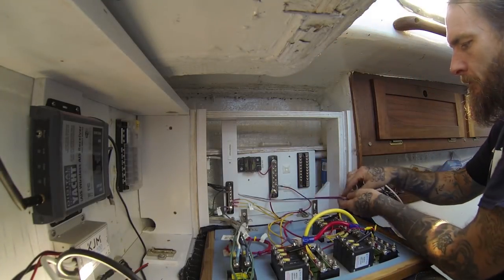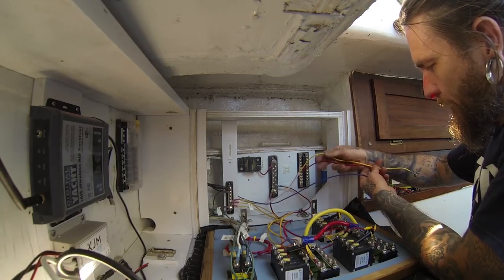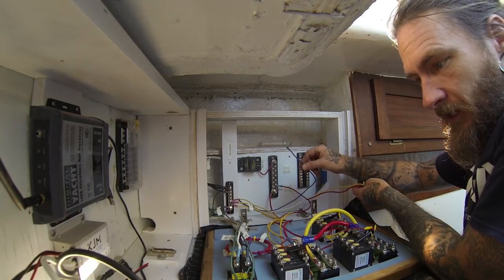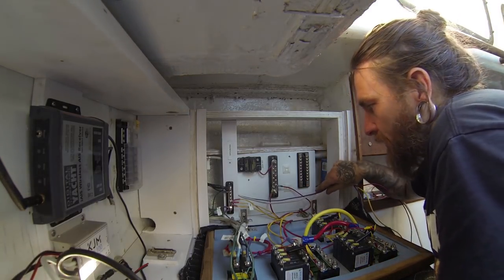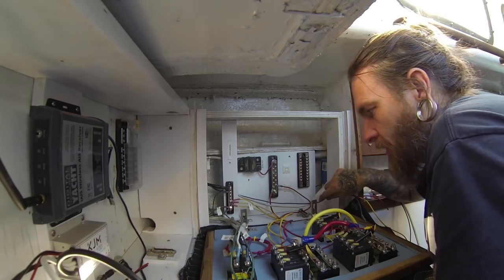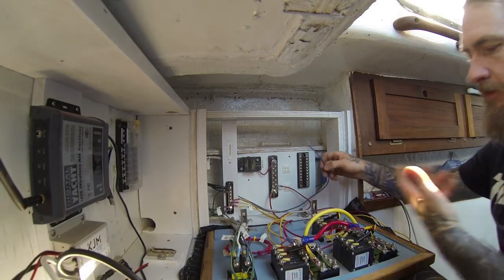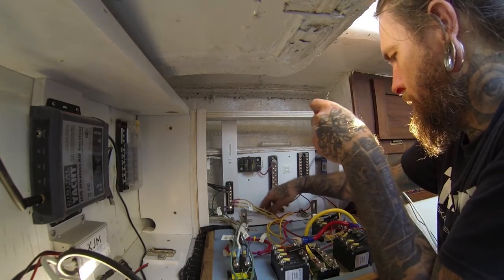This pair is my running lights — the red and green lights on the port and starboard. Then we have another one that's gonna come in through the lazarette for the aft light, and they'll all go on the same switch. I believe this is my steaming light — it's not labeled but it's zip tied to the nav lights. I have another one labeled anchor light, so I know that's not it, and then another unlabeled one I believe is the forward cabin lights. I'm assuming this is the steaming light — we'll find out, and if not it's easy enough to move.